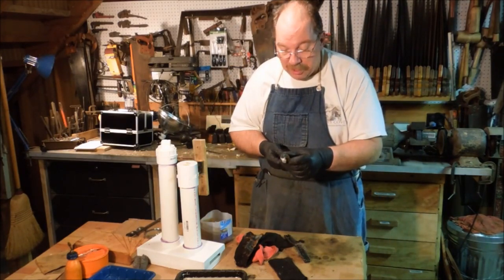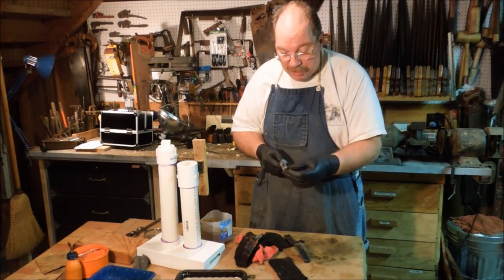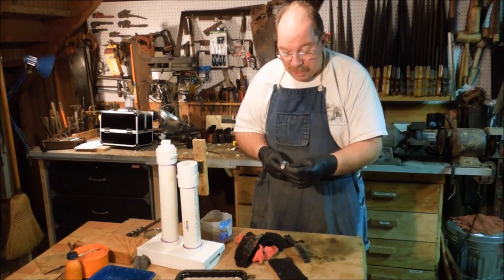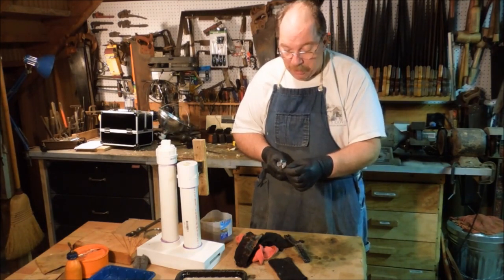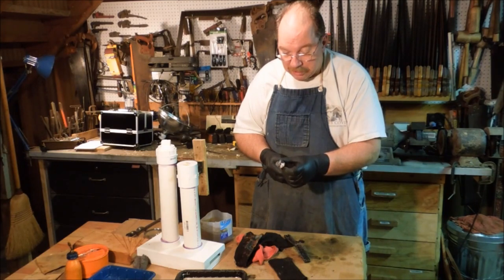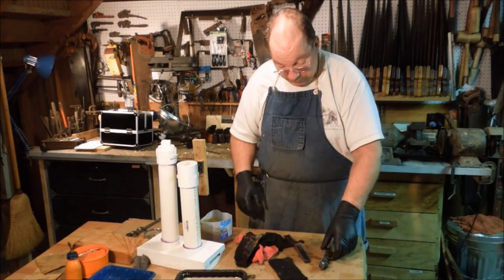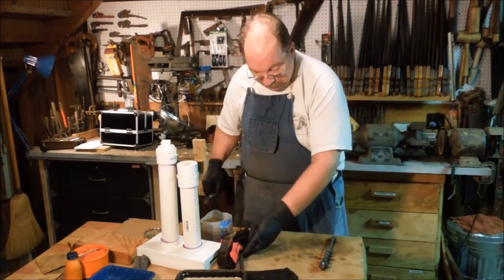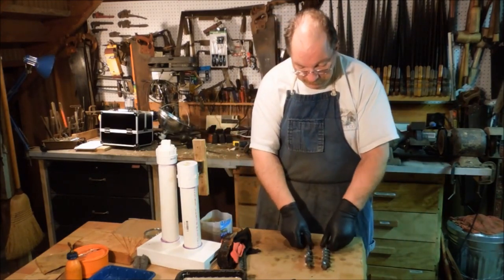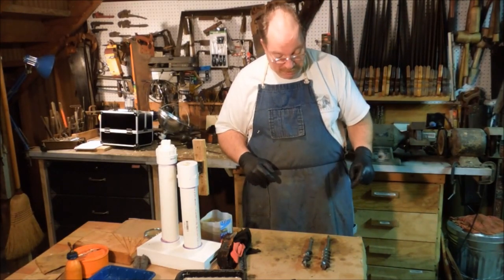This one's going to take some work to get it done. The radial cutting edges are still pretty good, and they haven't screwed up the timing on the thread. But those spurs are going to take a little bit of work, and they're right close to being too low to make a cut. So I have to be very careful with them. So that's my next video, sharpening these two drill bits.